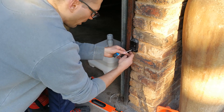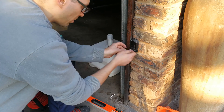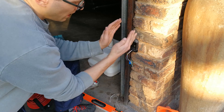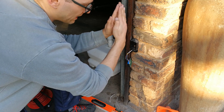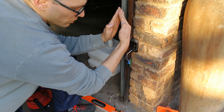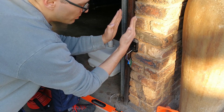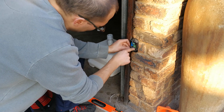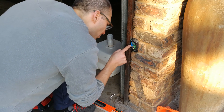You'll only choose normally open or normally closed depending on what your controller board or alarm system requires. Inside the relay you have three connectors with a leaf spring touching one contact — that's the normally closed position, which reads zero ohms. When the relay activates it closes the normally open contact instead. When putting the wire back in, make sure nothing blocks the photo diode that receives the signal, otherwise that would defeat the purpose.